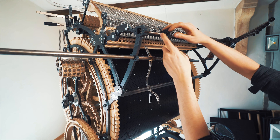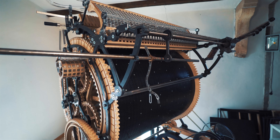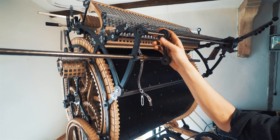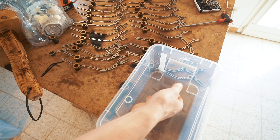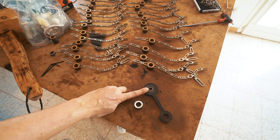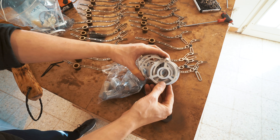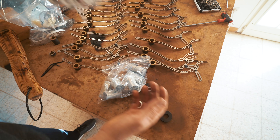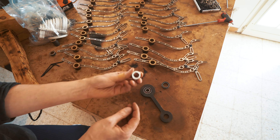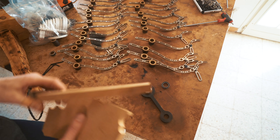Before I can attach this, I need to remove this, because I want to change this bearing to prepare for the next shaft size. This shaft is gonna be thicker. Why not make things more overbuilt if you can? This bearing is going to be changed into a bearing like this. Those belong to these parts, which is an exciting assembly, but that's for another video. This bearing is put in with the strongest Loctite, and I've never broken a bond like that before, so I have no idea what to expect. But I'm using a stop collet to only hit the outside of the bearing ring.